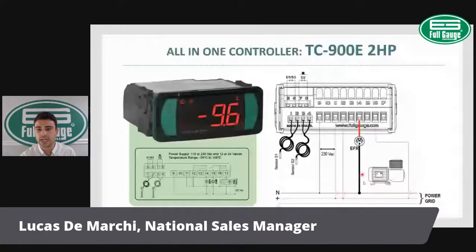Next to the heater, we're going to have the compressor connection on terminal 15. Again, we are feeding power through terminal 16 in order to energize the relay circuit for the compressor and fans. That way, you're going to have your hot line coming out of terminal 15 towards your compressor, and you're going to connect the other leg to the neutral. In that way, we are hooking up a 230 compressor on it.